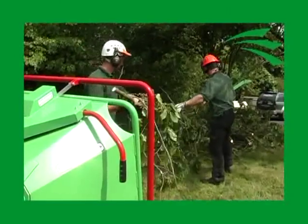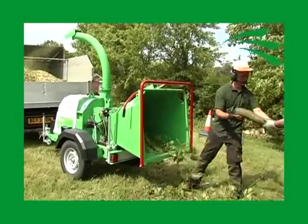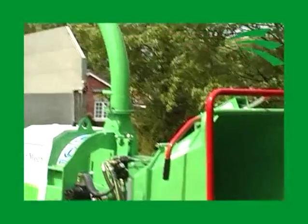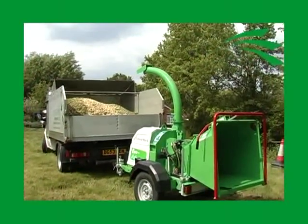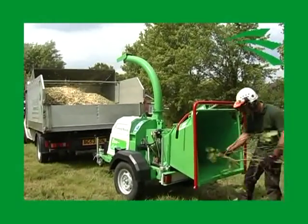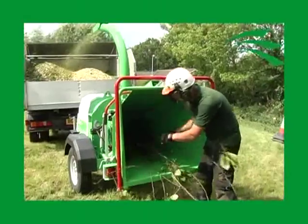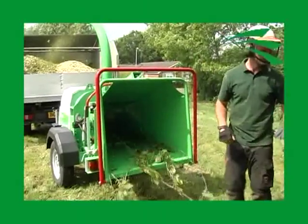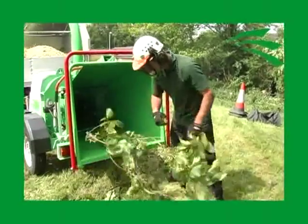The arborist featured here is fitted with a rugged 27 horsepower V-twin air-cooled petrol engine with a heavy-duty air cleaner. It has a single in-feed roller and an unbraked highway-compliant chassis. A bottom feed roller and braked chassis are available as options. The weight of all petrol versions is comfortably under 750 kilograms.